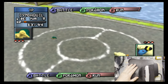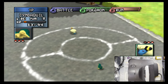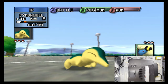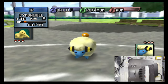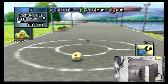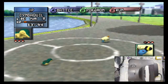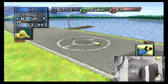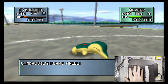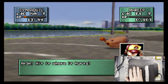Honestly, this is really not that bad. Given the price to performance that you get out of it, it is all that you need to plug an N64 into an HDTV. You can let the TV's scaler take over from there. Most HD TVs handle digital scaling a lot better than they do handle analog scaling. That, and this is probably still going to be higher quality than a composite output. In Nintendo's infinite wisdom, these things did not support component out of the box, but you could modify them to support component.